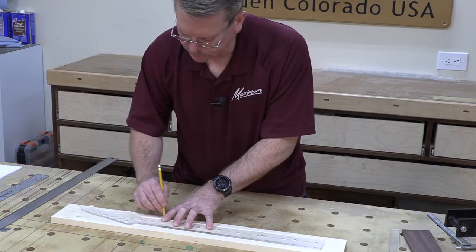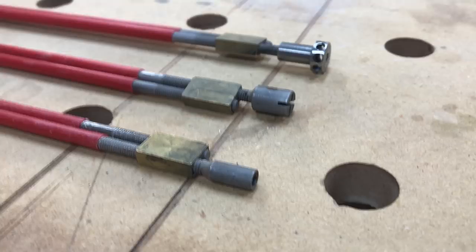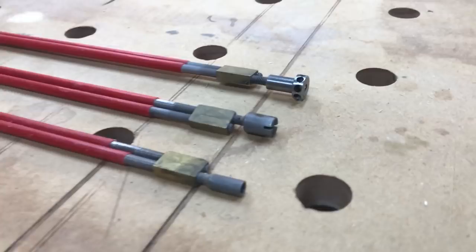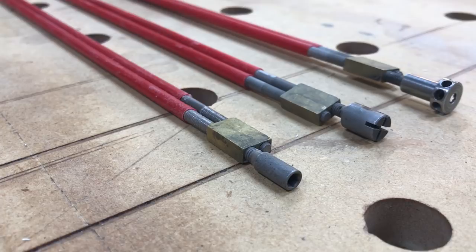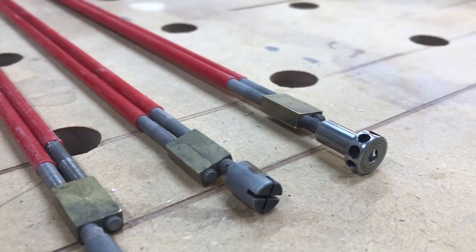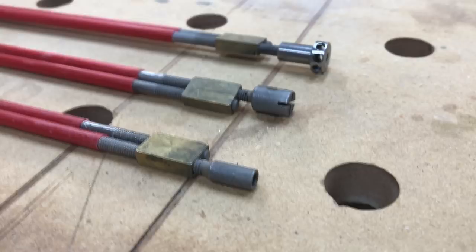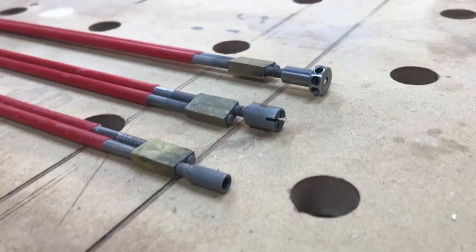I've got the template drawn. I didn't bother with the fret markers because obviously they're going to go in the fretboard itself. One thing we're going to have to decide with our neck is what style of truss rod to use. These are three from StewMac called Hot Rod Series truss rods. The first one on the left has an Allen adjustment that typically comes out through the headstock area. The second one is a slotted truss rod that is typically installed so it comes out the heel of the neck. I think what we'll do for this one is the center one — the slotted — and for the one we do in class, I'll probably use either the spoke wheel or the Allen, so you can see multiple styles.